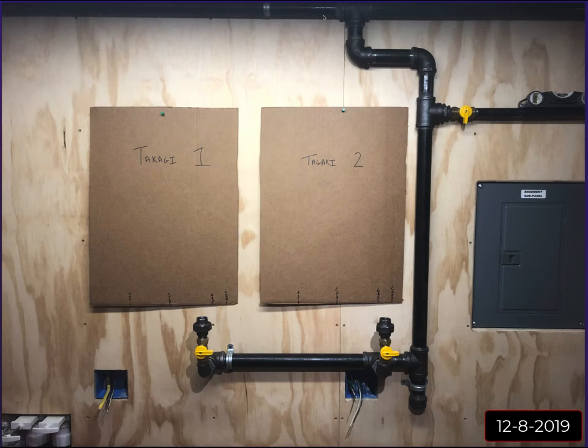And as you can see here, I shut the gas off to the house. I had a couple of nipples made. I just went to Home Depot. I either had the pipe already or I bought a piece of pipe and had them cut it and thread it for me to what I wanted. Here I put a half inch line, or three quarter it might be, that runs out the back of the house, and that's for a future natural gas grill if I want to put one on my deck and get rid of the propane one.